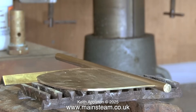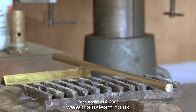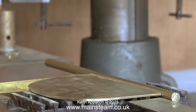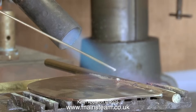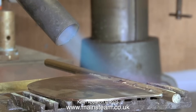The next silver soldering operation is different — I'm making a rudder for a large model boat, but the silver soldering operation itself is identical. The only difference is that you have to line up the parts accurately before you start, because once you start the silver soldering process, if they move around then things are going to be in the wrong position. I've thoroughly cleaned the parts and applied the flux to the rudder blade. The rudder shaft and blade assemblies are supported by a piece of fire grate — stainless steel fire grate from Black Gates Engineering — which is ideal for holding parts like this.